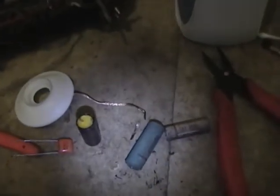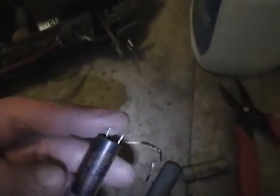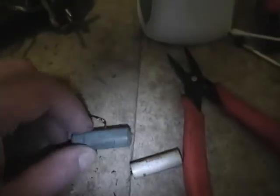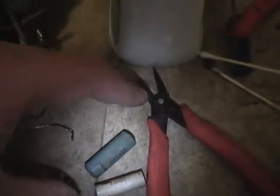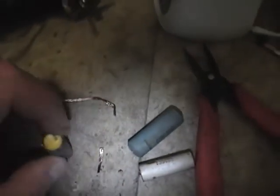I just discovered there was one more capacitor hiding on this main board here. It's this guy, which is a little bit unusual for a vintage set. Normally they're this type, which they call axial, meaning the leads come out along the axis of the body, whereas this is what they call radial style, meaning they come out at one end. So to replace that, I will use one of these little chiclet guys.